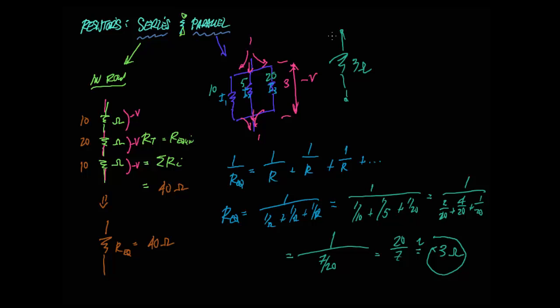It's about 3 ohms. Now there's a reason we build something in parallel, so that if we burn something out or if this branch is turned off, we can still have the circuit completed, things will still operate. Just as a note, the old Christmas lights were wired in series, so if I blew out one bulb, guess what? They all went out. And then you had to find which one burned out, which was a pain. Now they make it more in parallel, so if I lose one bulb, everybody else still burns brightly, but we can see the one that's dead. But what also happens is the current increases in all of the rest of them, so you can burn out more if you don't fix it. So there's a quick thing on series and parallel.